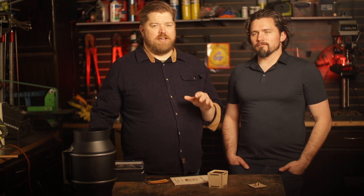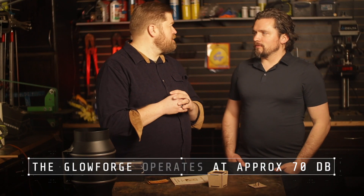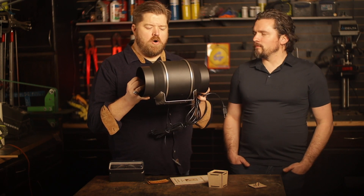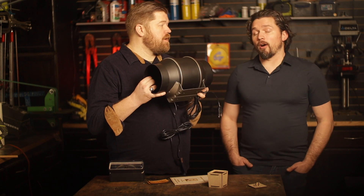The Glowforge is available in multiple different powers, but there are a lot of other laser cutters on the market that range hugely in their power spectrum. Know the scope of your projects and don't overspend or underspend. If all you're doing is lightly etching leather, you don't need a laser that can cut quarter-inch stainless steel. Tip number two: these things are noisy. The videos promoting them make these machines seem quiet — like you can use them in your living room or office — but they're loud. Most of the sound is from the internal fan pulling smoke out of the machine, almost as loud as a leaf blower. One solution is to get an inline fan, which we'll link below. It's a six-inch fan requiring some ductwork, but it's significantly quieter and more powerful than the internal fan.